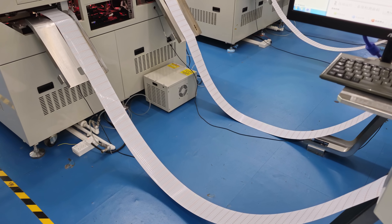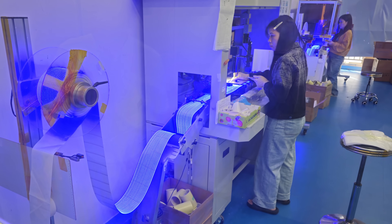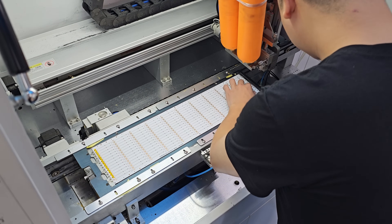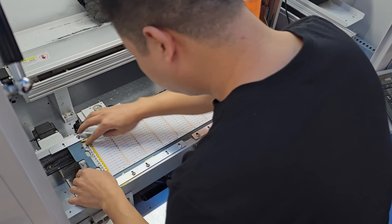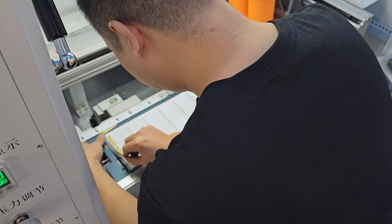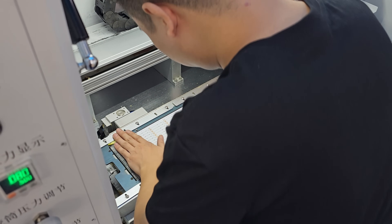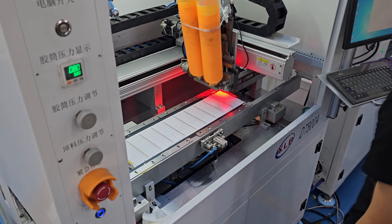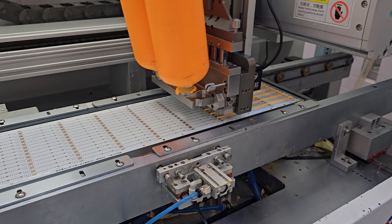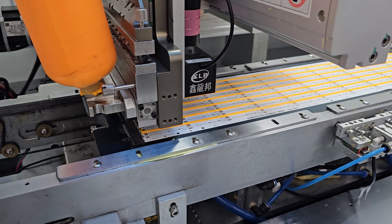They also have a different manufacturing method where they manufacture giant long rolls of this LED strip, so they also have a different method of checking those, with two ladies in a booth doing the same work as before. Now after these half-meter sections are done they go to the phosphor application machine — I don't know what they call it — where they fix these half-meter sections in place and then apply a carefully calibrated phosphor which will turn the blue diode into white light by filtering out the other frequencies. That's already starting to look a lot more like the LED strips we recognize.